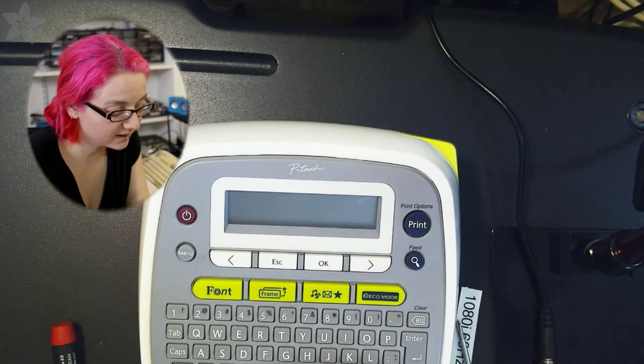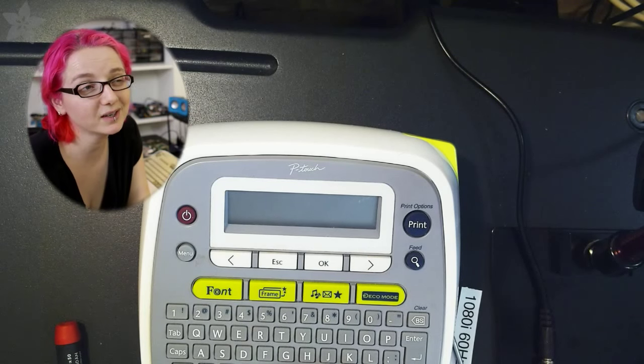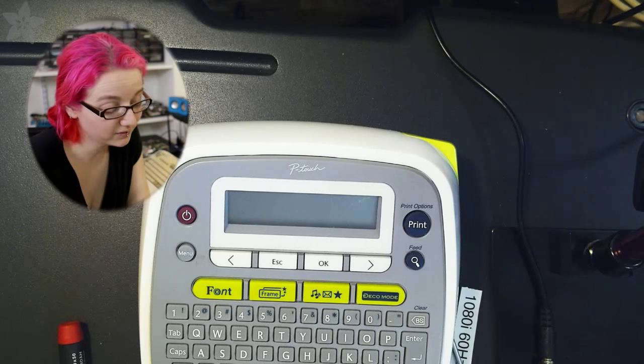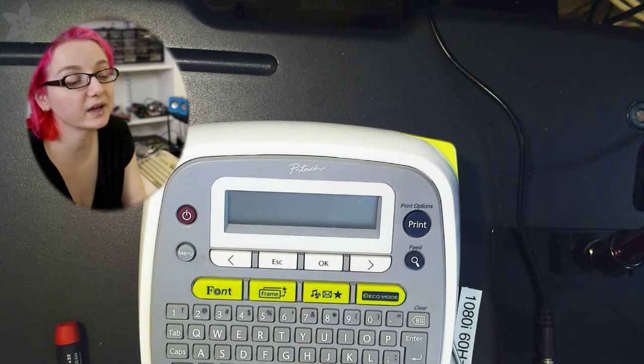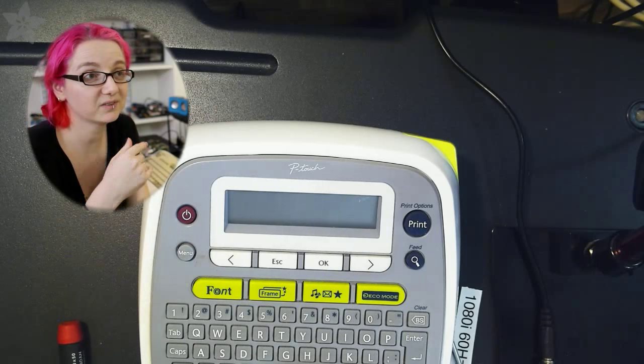That said, most devices are kind of okay. If they say 9 volts, you can sort of get away with 12. It depends a little bit on the device, but if you have a buck converter, go for it. If you can get a 9 volt wall adapter, I'd probably get one.